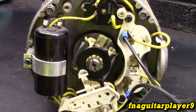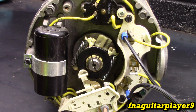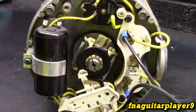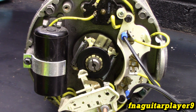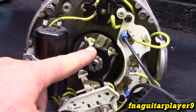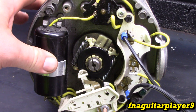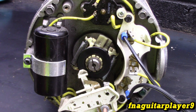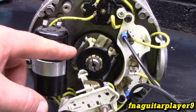There are a lot of different types of motors. This is a very common setup on a lot of single phase motors. Just about any time you see a motor with a capacitor — what I call a wart on the side of it — it's usually going to have some type of centrifugal switch. There are a lot of induction motors that do not have starting windings or a capacitor like this and just work off the main run windings. Three phase motors — I've never seen one with starting windings like this because they work completely different, and I've never seen a capacitor on a three phase motor. But for single phase motors, this is an extremely common setup. This is even used on the older style washer and dryer motors. Anytime you hear that distinctive sound when you shut it off — the click and the rubbing sound — this is what's going on inside.